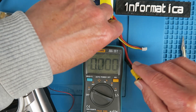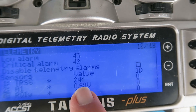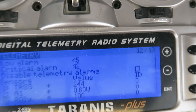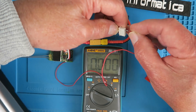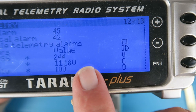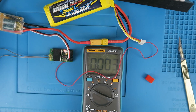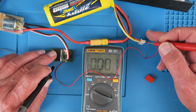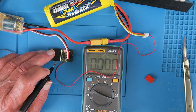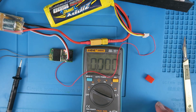The transmitter is on. Let's connect up our battery. At the moment there's just the RSSI. Our A1 is the voltage. Let's connect that up now to the last cell position — and it's giving us a voltage there of 11.2 volts. Let's see how close that is to my DMM. We're seeing there a value of 11.36. It's reading a little bit low but nothing really to worry about, and we can calibrate the value on the transmitter — that's not going to be a problem.